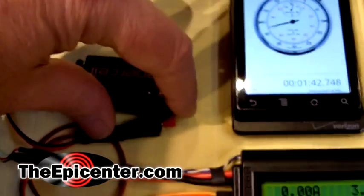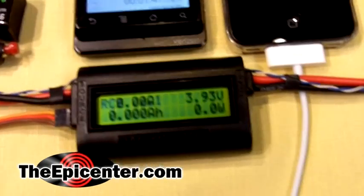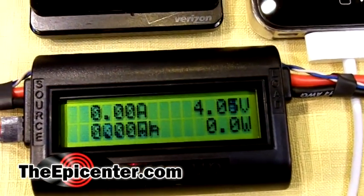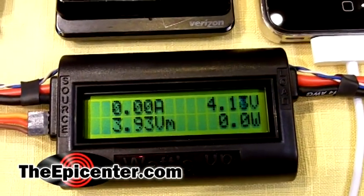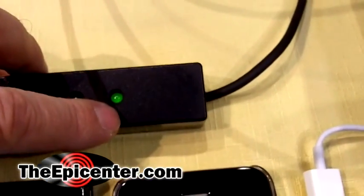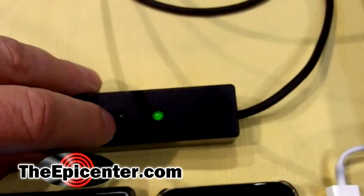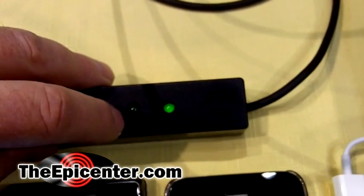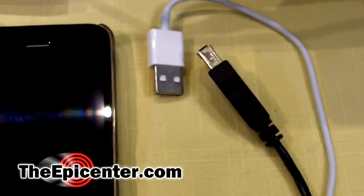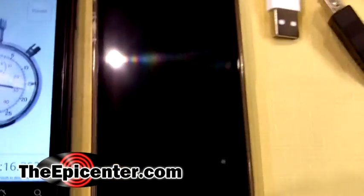We're going to go ahead and reset this so it boots back up and starts measuring data. From that meter right now, you see we're at about four volts — not optimum for USB charging, but this light is beginning to light. When it comes on full brightness the output will be at five volts, but you'll still want to wait until the second light comes on for a high-power device like this iPhone. The iPhone is not connected right now, and I'm going to try to turn it on — you'll see it's completely dead.